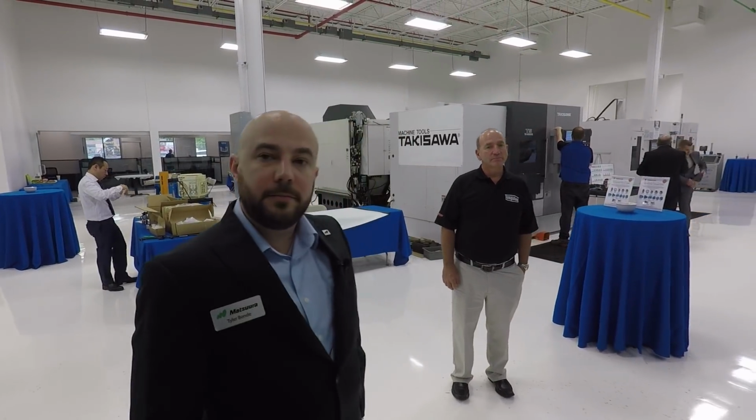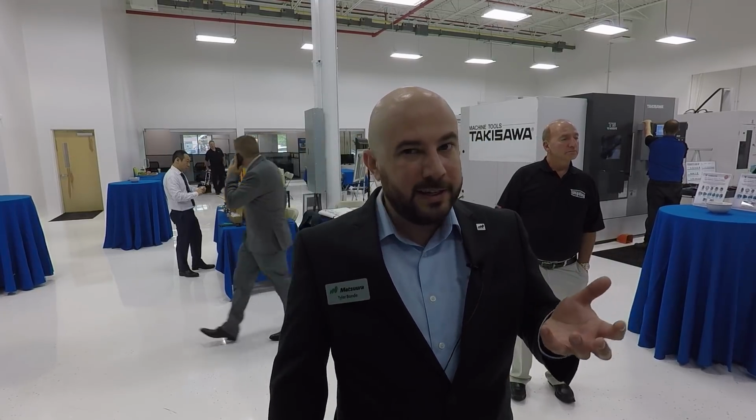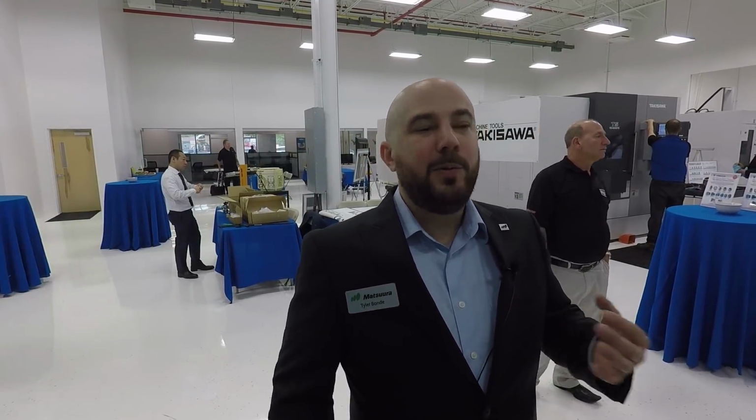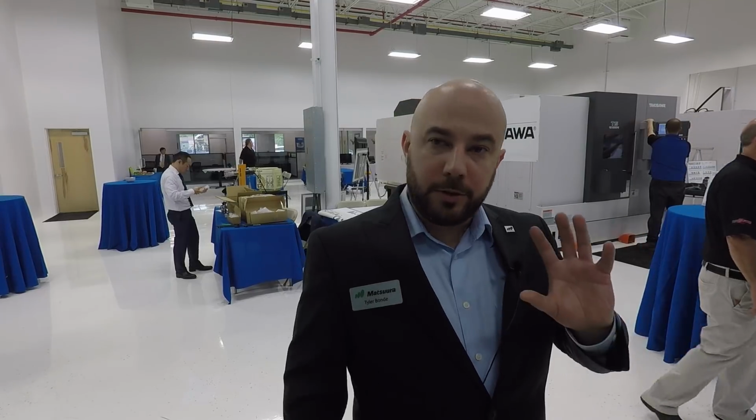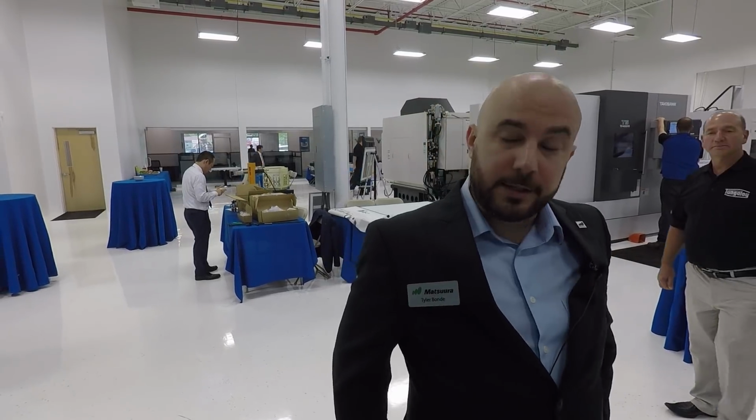And would it be a C-axis? It's actually B. Okay. And is that positional or simultaneous? So we offer a positional, but really, we usually don't import them like that. We'll do a direct drive, glass scales on everything. Which means it is full, true simultaneous. Got it. Exactly. Very cool.